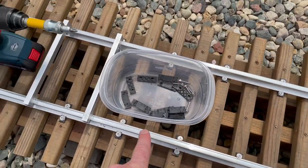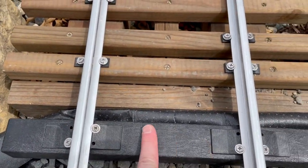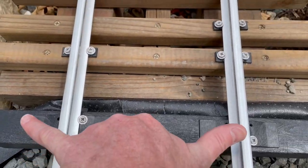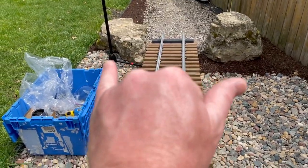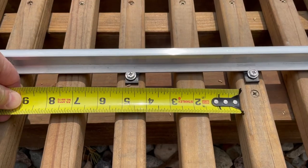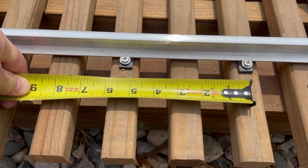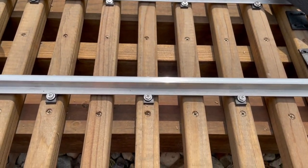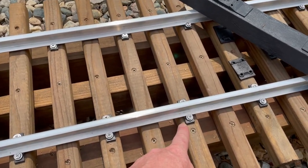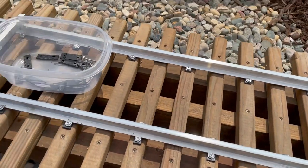What we're doing right now is getting the tie plates on the bridge. To get started, I fastened an AccuTie tie — I tend to use these as gauge bars — so I put one on each end to get the rail together and put in place, then did two there and started doing every other one, which leaves about five and a quarter inches on center. I did that in case I had to switch things around or maybe over time double up where one fails. Lots of videos to come on maintenance and how things are going.